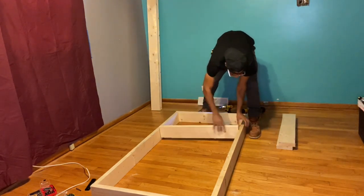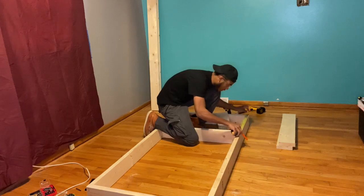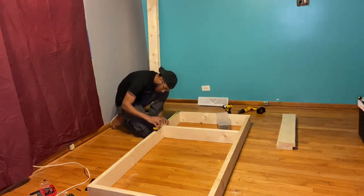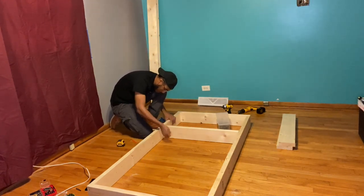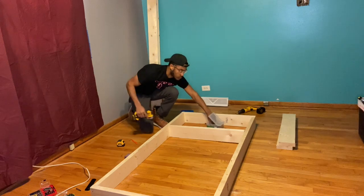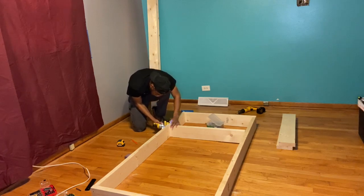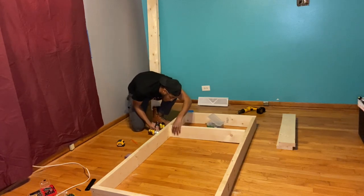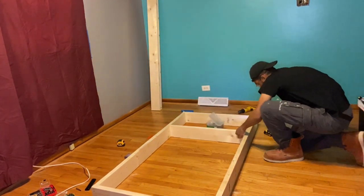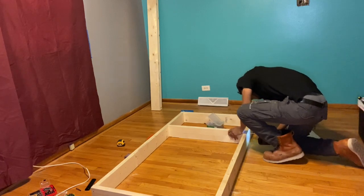Cool. Now we can start putting in our supports. These pieces are what supports the load. And this is just for the bottom frame. So I measured out each one. Make sure you pull from the same side. Get it on the line and fasten it in. Now again, I'll be sure to put the measurements in the description, but I put each support 16 inches apart. So what you see me doing for the first one, I just repeated those steps for all the supports.